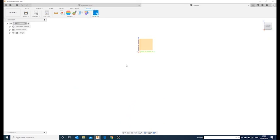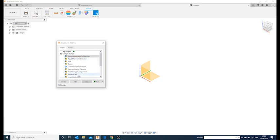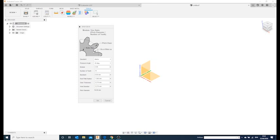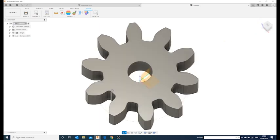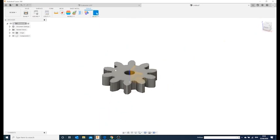The first thing to start with is creating a gear as a starting point. Within Fusion 360 under Tools and Add-ins, there are a number of scripts you can download. One of them is Spur Gear, which I use. If I hit Run, it asks several questions. For this gear I'm using a module of 5 and 10 teeth — module times teeth gives the pitch diameter of 50 millimeters, which is the mesh diameter. Click OK, ignore the error message, and we've got a nice 10-tooth gear as a component.